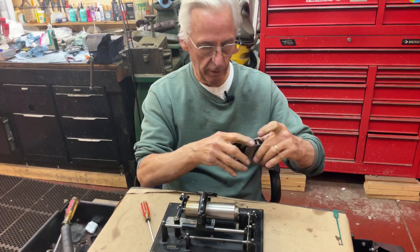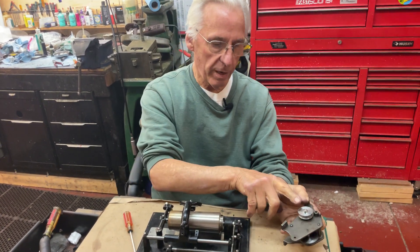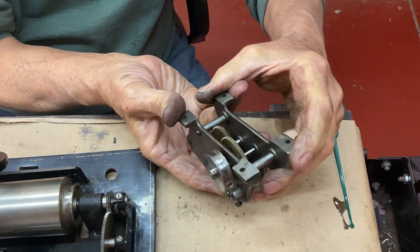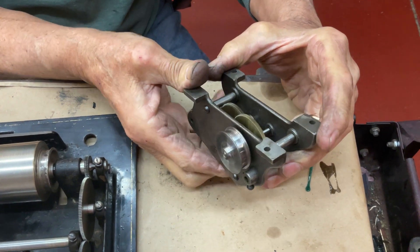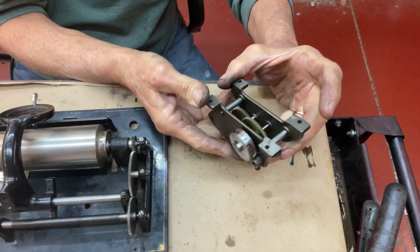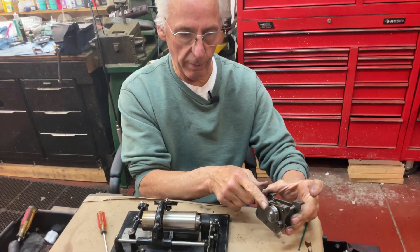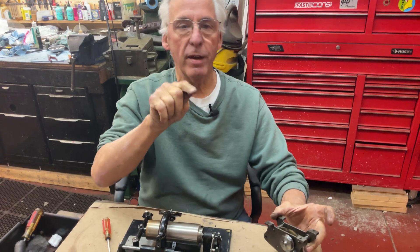The gear train is the same way — very quiet. I had to re-bend the end that holds this; it was really wobbling. But when you bend them back into place, the center piece is running so it will track perfectly with the belt. You don't want to go to the expense of changing the whole shaft out if you can get them to run smoothly. These are notoriously weak — you barely touch them and that little one-eighth inch shaft just bends.